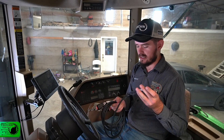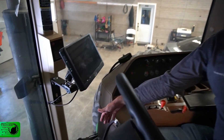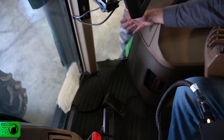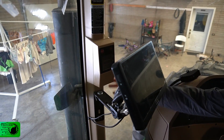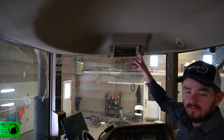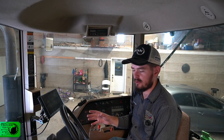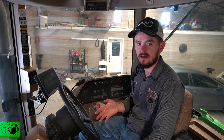The last cable is the one that goes from the main harness to the GNSS receiver on the roof. On this tractor it's plugged into the harness under the floor mat and routed all the way up behind the plastic, behind the radio. We drilled a hole in the roof and from there it goes to the GNSS receiver. That's the best route for this tractor — it might be different for yours, so find the best route for your specific tractor.